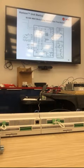So we put a lot of thought into figuring out how to give you more diagnostics for trips and things of that nature. Yeah, so the heat failure also, we've only done this for the gas heat up to this point, but for the electric heat enable and safeties, we also do this, adding the same relay back, so we'll also have the heat failure diagnostics on units with electric heat. So it won't be just the gas heat moving forward.